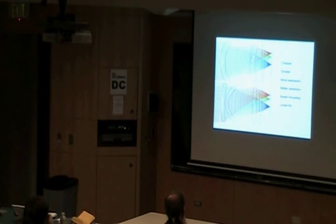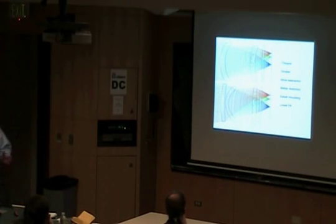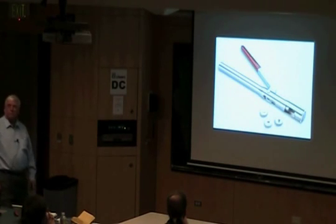If I made the beam the same size, the MTF might come up. So this is the argument that you can make a perfectly plausible lens. Now, what else is different? If you want to put a wavefront encoding device in, you can put it maybe someplace on one of these surfaces at the same time you're molding the lens. Right? That could be anything you need. So I believe that lends itself to cheap, high-volume manufacture with any shape you want.